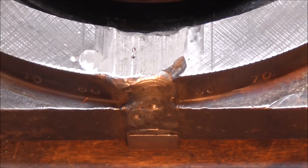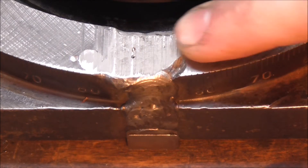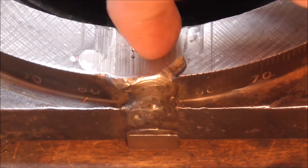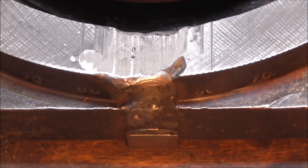I hate to say it but on the very last cut a chip got caught on the insert and the surface here is very, very rough. Not ideal, but nothing I can really do about it. And instead of grinding it out again and welding it up again, I'm just going to leave it as is.